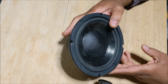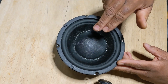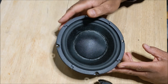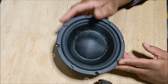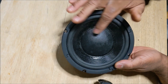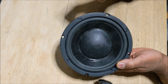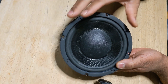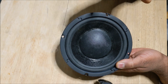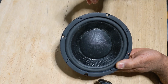When I plugged this up and listened to it, I was really surprised — it seemed like it had a really giant peak around 3,000 Hz. I was shocked because on paper from the manufacturer it's flat up to 2,000 Hz. But since this 3-inch dust cap was placed on this woofer, I don't know if that's the reason why the response has such a peak at 3,000 Hz. It was clearly audible. I listened to a lot of tracks and it was just something that stood out — really peaky at 3,000 Hz, a big shouting response from this driver.